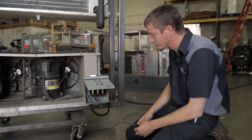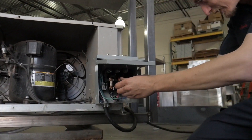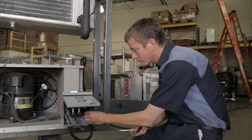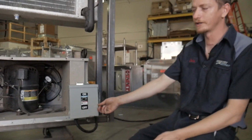There's no voltage there. You can take a screwdriver or a pair of pliers, get in behind the fuse just like this to pop one side out. Then you can grab it, yank it out, take a new fuse, pop it in. Close it up and turn it on.